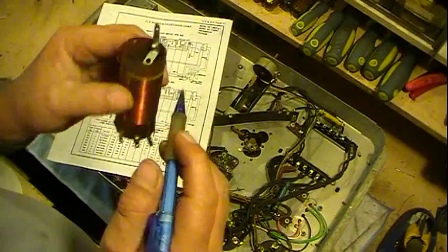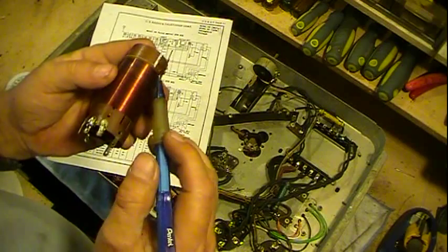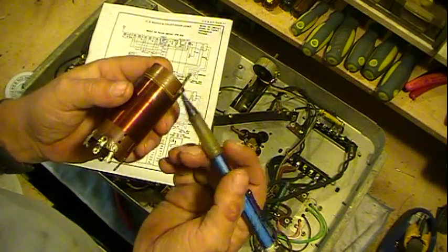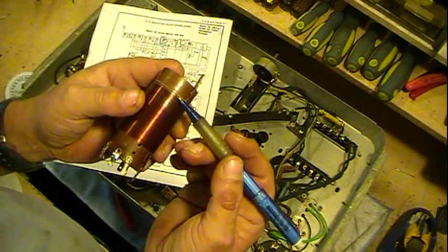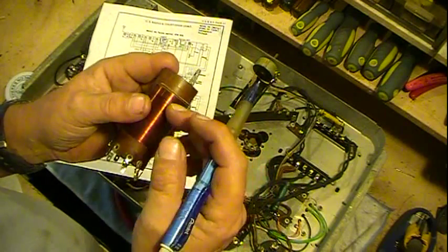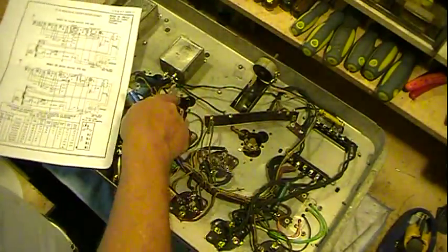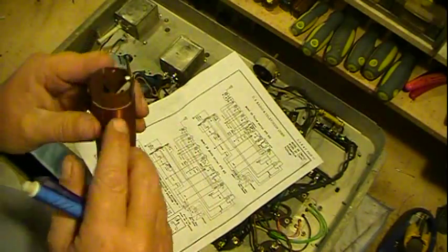And that's what they did, was they just took a wire, connected it to the inside coil here on one end, brought it up, and just wrapped it just above for a short distance and tied it off just above the secondary winding in close proximity, in parallel. This is one plate, and the wire underneath it, that's part of the windings of the secondary, is the other plate. So that's this capacitor, and the other two coils are exactly the same way. So I wanted to show that to you in a different form.